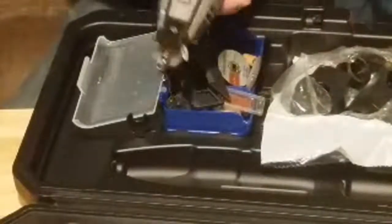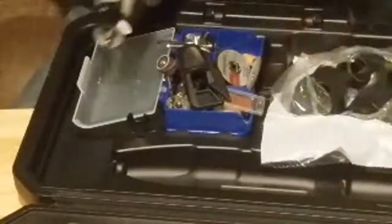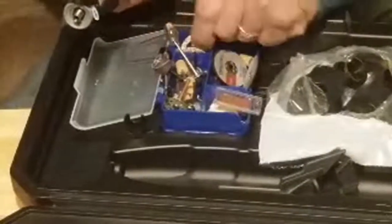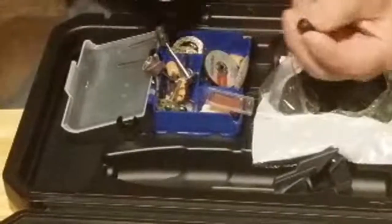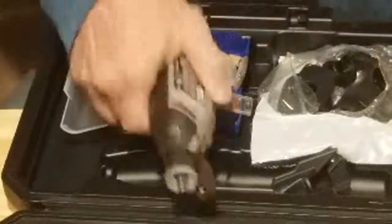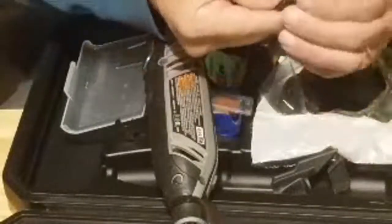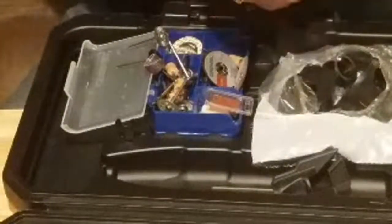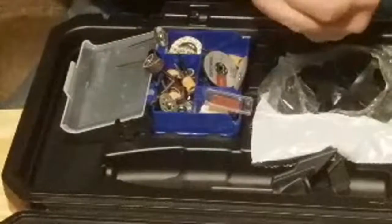The 4300 is the only Dremel that comes with this chuck, because all the other Dremels use a collet like this right here. Normally it's this collet. This is the 1/8 inch insert for your tooling, and then this goes in here, and this tightens down. Get this in place, for example, so this slides in here.